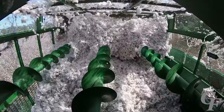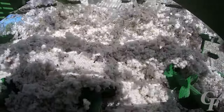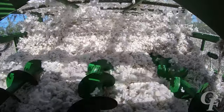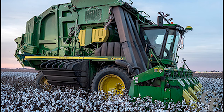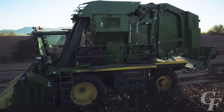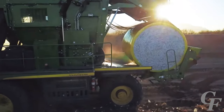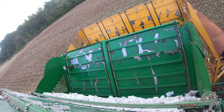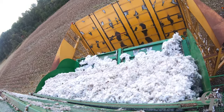This is where the design of modern cotton pickers can differ the most. Modern cotton pickers have on-board module builders and do not need any extra machines in the field to put the cotton into a package that can be transported to the gin; these pickers can harvest non-stop without ever stopping to dump. However, this efficiency comes with a big price tag — these module-building pickers are extremely expensive, with new ones costing close to nine hundred thousand dollars. After the basket is full, other operators unload the basket into a boll buggy, which carries the cotton to the stationary module builder.